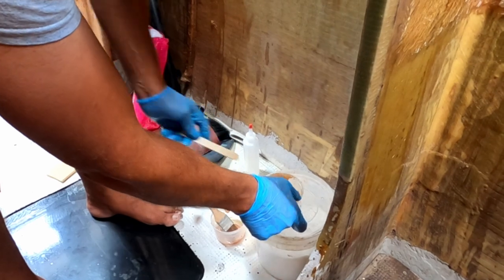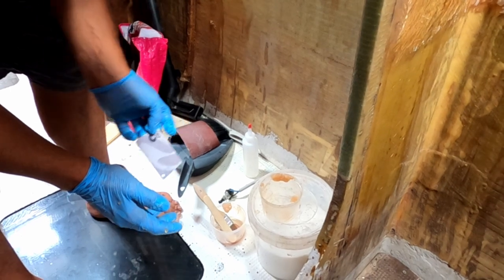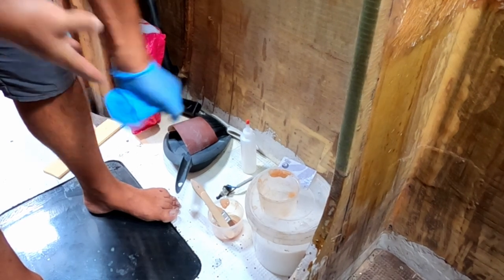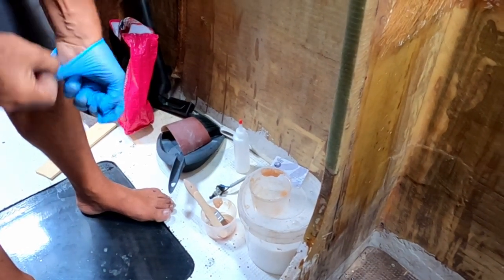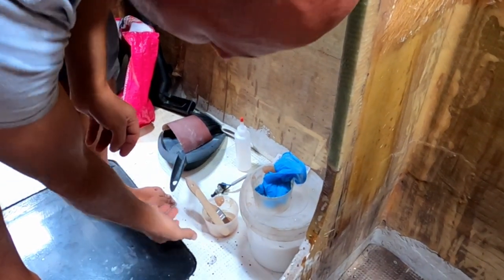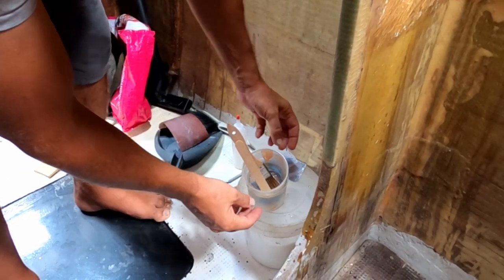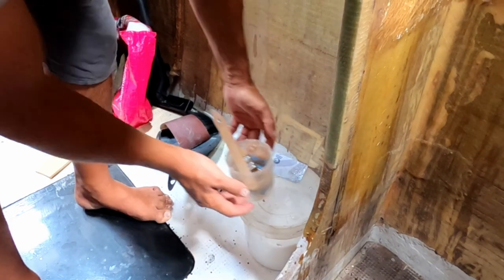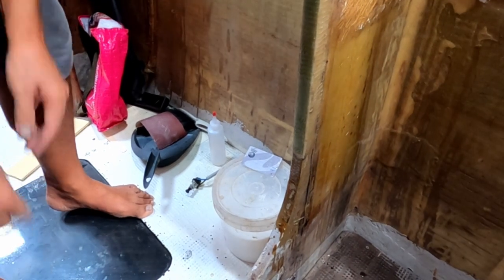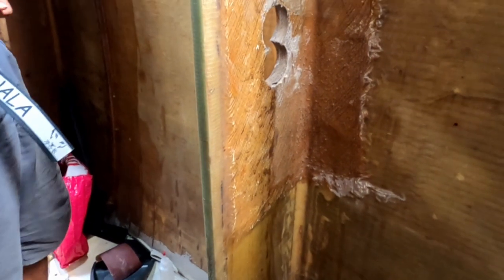Doing them in Kevlar can be done, but it's a major, major pain in the bum because Kevlar is a terrible material to work with. Absolutely terrible. I can't stress enough how difficult it is to actually work with it properly. To actually get proper fiber impregnation is so hard. Even when you infuse it, you still don't get full bundle impregnation, and hand laminating it, got no hope. Just cutting the dry fiber is hard. Sanding it. Anything associated with Kevlar is a pain.